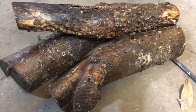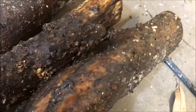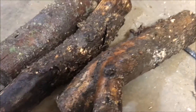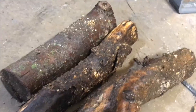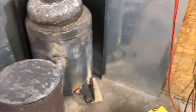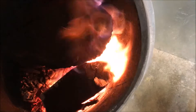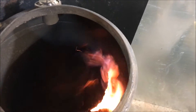What's up guys, today I wanted to show you the power of a cyclone wood burner and why I build them — why I don't have a conventional fireplace. What we're looking at here is a pile of very, very wet wood. Sometimes you're just in a crunch and don't have space to manage your wood or time to do it. This is a negative pressure wood burner that uses a blower outside the building to pull air into the combustor, so we don't worry about leaks. It's so effective — there are massive wet logs in there and they're putting off a pretty good sized flame.